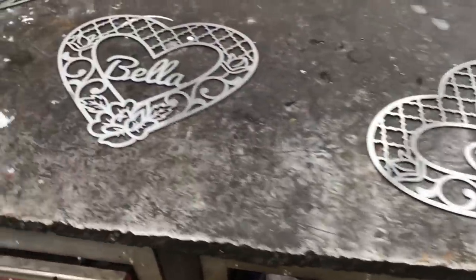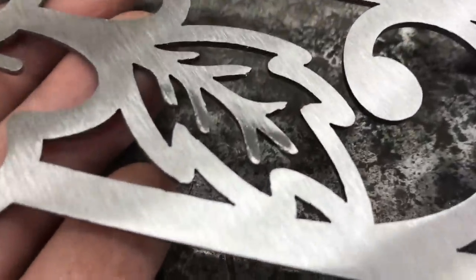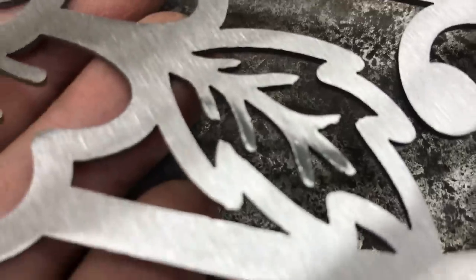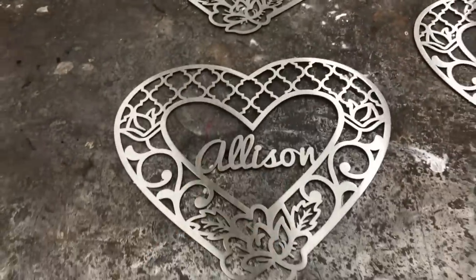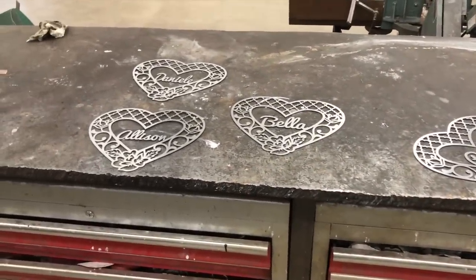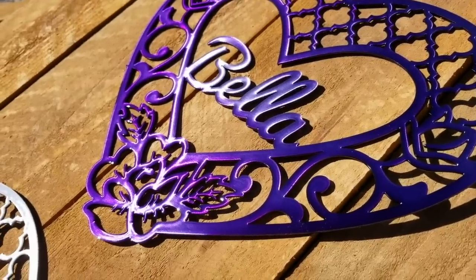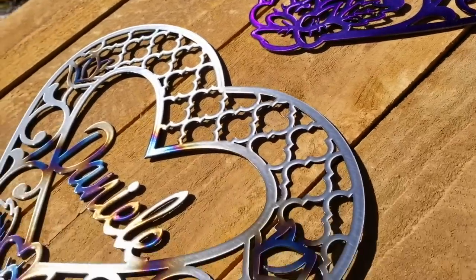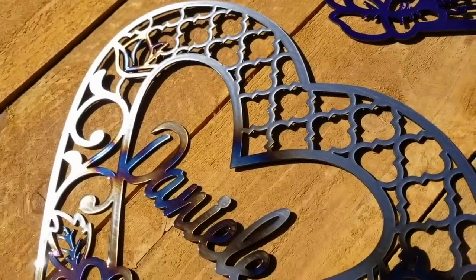There's a look - one pass through the belt sander, this is 180 grit, and here's what it looks like on the back side. Pretty clean. You can see on those fine details there's a little bit of heat affected zone and a tiny bit of dross - like one little speck right there - but overall I could not be more happy with that. Here's the electric candy purple, this is a brushed metal with torched heat affected accents, and this is candy bubblegum pink.